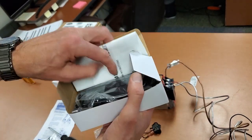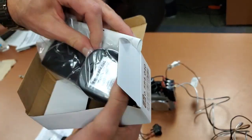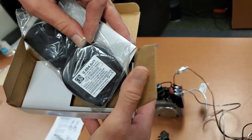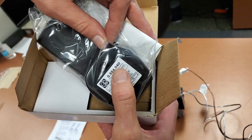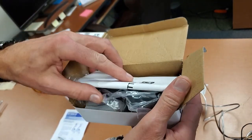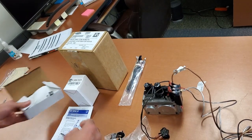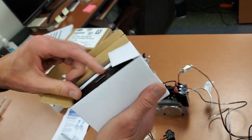On the remote control, it's a standard SIT remote. It needs to be either the old 584.023 — which was a common one — or the newer 584.040. If you have one that's .080, that's the wrong remote and it's not going to work for this particular system.